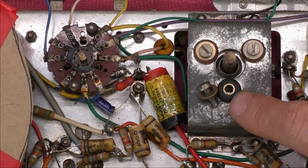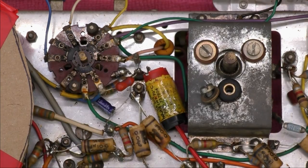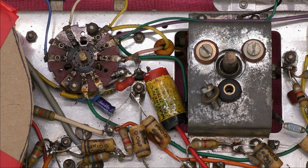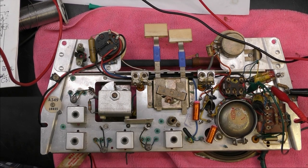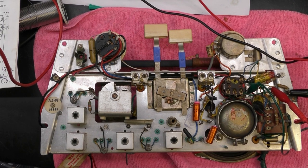Just in the process of replacing the grommets on the capacitor - you can see they're well gone. Good thing to have is one of these little boxes of mixed grommets - very useful when doing work like this. Likewise I've got a box of o-rings as well, which is handy, perhaps for tape recorders too - you can get them fairly inexpensively, so they're worth having in the workshop. I've cleaned the capacitor up best I can and re-oiled it. Put a bit of grease on the wavechange switch.